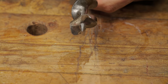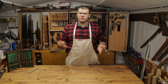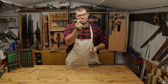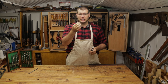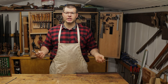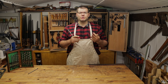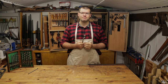So obviously now this auger bit is nice and sharp and it's ready for use. There you have it folks — that's how you sharpen an auger bit and it really couldn't be easier or quicker. You just need to make sure you're selecting auger bits with no damage to their lead screw, and getting yourself an auger bit file. Auger bit files are not that expensive, are well worth the investment, and allow you to sharpen from your largest auger bit down to the tiniest. Thank you for watching. If you like this video please consider liking and subscribing, check out my Facebook and Instagram pages, and if you'd like to support me further please consider checking out my Patreon page. A big thank you to my current patrons, everyone who's subscribed to the channel, and you the viewer for supporting me. Bye for now.